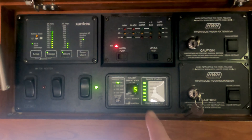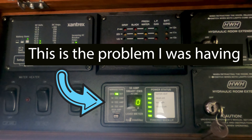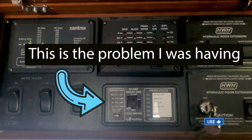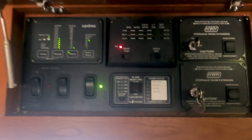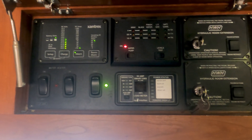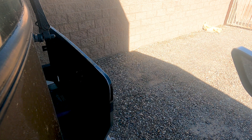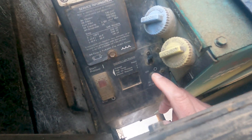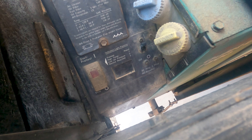The problem I was having is when I would kick on the generator, this would kick up and show volts and then it would black out and go blank — I wasn't getting any power from the generator. I did somewhat of a jerry-rig fix, and I'll show you what I did, but first I had to find out what the problem was. As the troubleshooting process led me, let's go check the breaker on the generator. Looking at my generator breaker right here, it shows that it's on, so that's not my problem. The next spot we can come down to investigate...